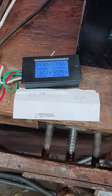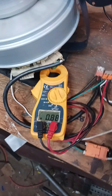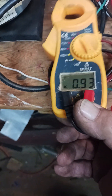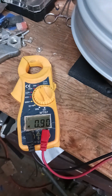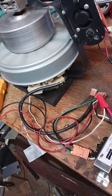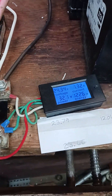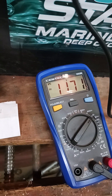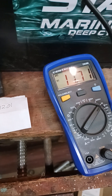We're at 24.31, 24.32 — I stand corrected. I'm reading 0.88 on my amps. Must have been getting interference underneath the machine. Moving it over here, we're looking at 0.90 AC amps coming out before it goes into the transformer. We're at 24.35, and I think we're losing one more tenth of a volt, but we've gained that in our charging on both batteries.